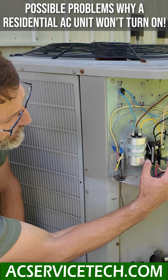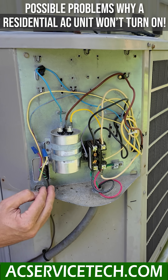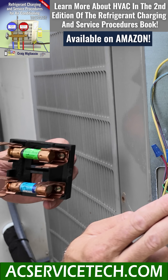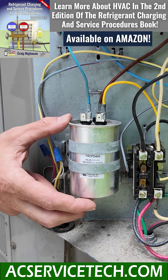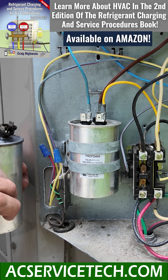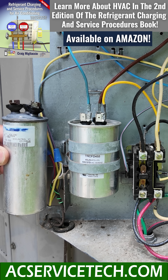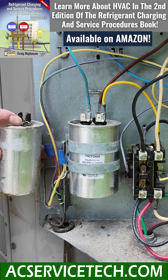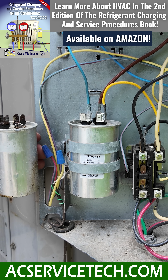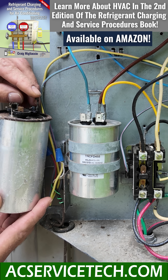You could have no low voltage power to the contactor telling the unit to turn on, or maybe one of these components in this outdoor unit is bad. We do have our disconnect in the off position. We could have a bad capacitor out here — one that has a mushroom top like this, which means it is bad and no longer functioning. We could be leaking fluid from it, or have one with a bad weld at the top that could be burnt apart. Another thing is you may have a burnt connection like this that is just melted apart.